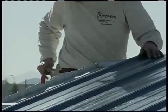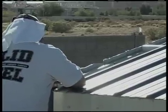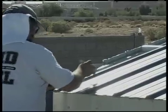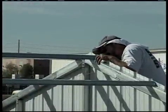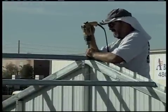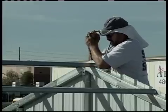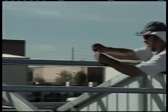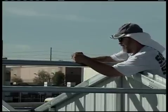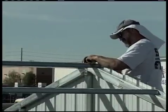The roof panels are cut to allow for a six-inch overhang past the eaves, which means you would start them about four inches down from the peak. If you want less of an overhang, just start them closer to the peak. Drive a number 12 by one inch frame screw halfway into the first frame, four inches down from the peak, and one in the last frame at the other end. Now stretch a string line between these two — this is your top guide for keeping panels straight all the way down the roof line.